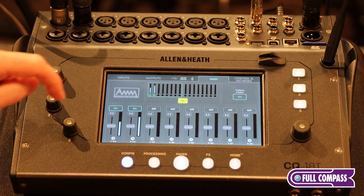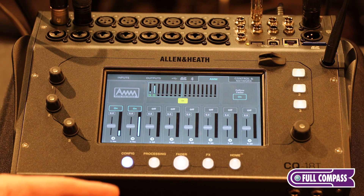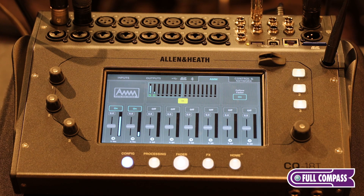So we're already gained up, and if I switch the first two in where we're connected up — if I'm talking, you can see it's giving me the gain. And if I'm talking, I get the gain. It's basically like turning a fader up and down automatically. It's very quickly listening to the signal and giving the gain only to the person who's talking. So that reduces background noise and clears everything up — it's great for broadcast, podcast, and anywhere there's speech.